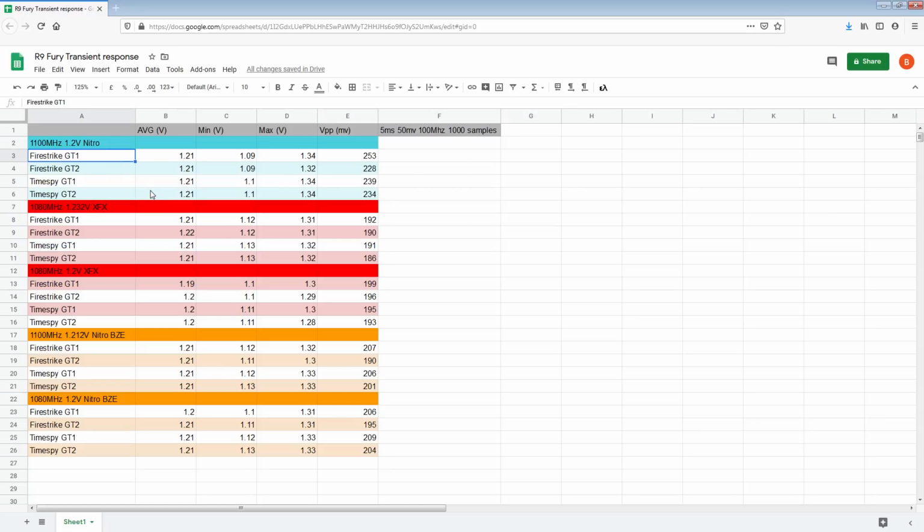But I kind of want to drop one of the graphics tests, or maybe throw in a different GPU workload. Maybe Unigine Heaven. No, Unigine Heaven's 4 minutes. I actually run these on loop, because depending on where exactly you start recording in, say, Firestrike or TimeSpy, that'll initially skew the results a bit, because some parts in Firestrike cause slightly higher transients than other parts. But if Firestrike runs 5 times in a row, it doesn't really matter where you got your first 10 results from, because it averages out to something pretty representative of the overall thing. Which is why I test the way I do and have 1,000 samples.